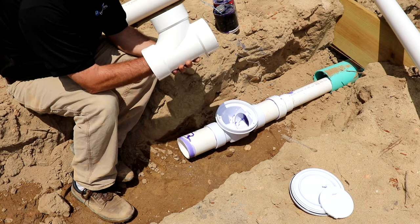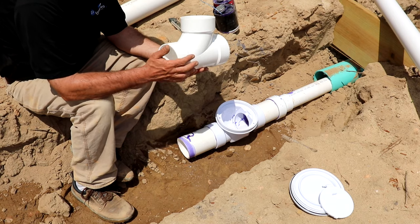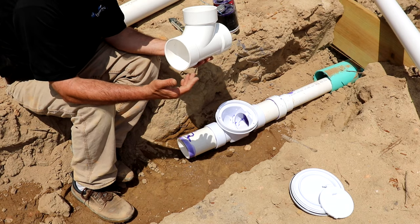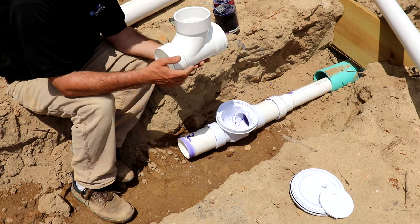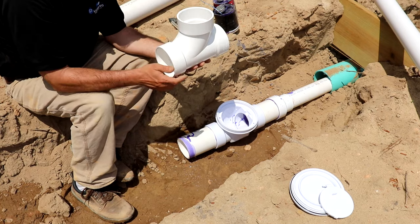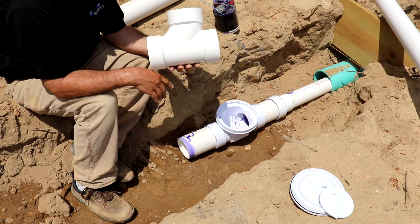Well, you'd think most vents, it's not a sink dumping onto a vent, so it's a dry vent. But you gotta think, there's hot, steamy moisture going up through those vents out the roof. It's a lot of condensate coming down. Pine straw or leaves can fall in there. And these things are prone to clog if you lay them on the back like this.